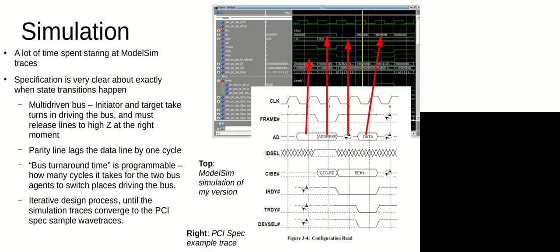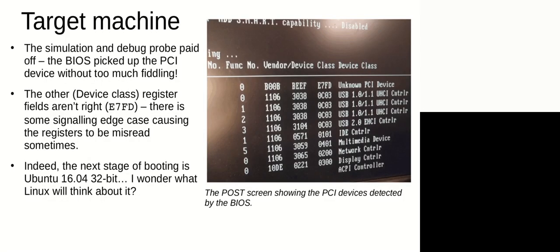There was also a simulation process. Once you implement the PCI hard integral IP you can't easily debug it as it's running — you really need to simulate and verify at the simulator level. In my case that meant writing ModelSim test cases for both the initiator device and the target device, and comparing against the PCI spec signal waveforms, which were thankfully available. After about a month of verifying, testing, verifying, and testing, I got the BIOS to see my device. You can see vendor ID 'B00B' — it's a bit silly but it's distinct and I know that's my device. It shows as unknown because the class bit field isn't quite right, but the BIOS can see it, which is a very good sign.